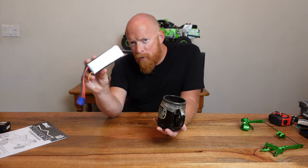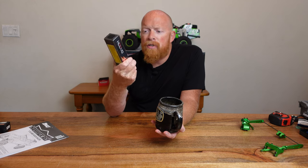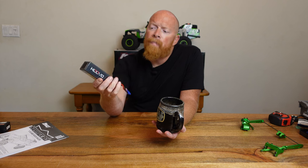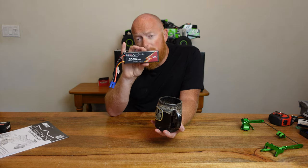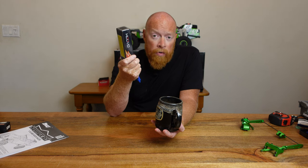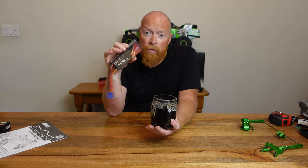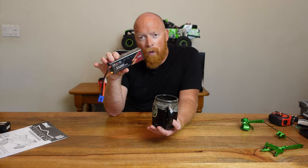Real quick, as I was taking a look at what I was about to put out there so you guys could see, I accidentally used the word dump instead of continuous discharge. If you see 120C, that means 120 continuous discharge. That's not your dump. Your dump rate on a 120C battery could be up to 240, could be 200. There are some companies that tout what it could be and they say up to, or they say exactly what it is. But I think from testing, people have been noticing that they're not getting what it's actually said on the batteries.